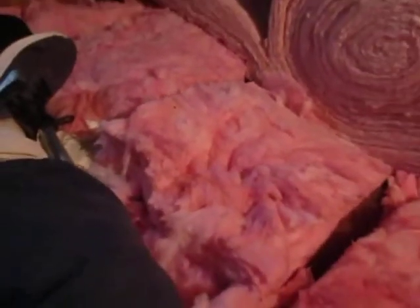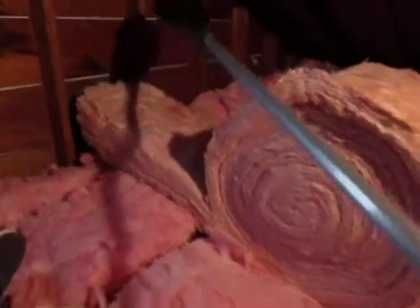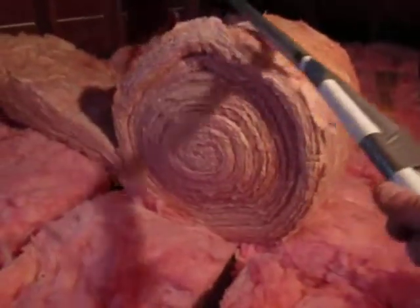I had this insulation installed across the beams before, and they asked me to put the insulation between the joists. When I did that, it's not the easiest thing to do. What I ended up having to do was get a canoe paddle, tape it to a post, and use that to reach and lift up the insulation and put it in the eaves.